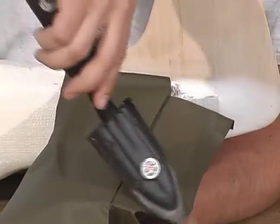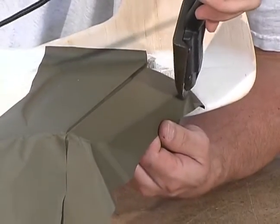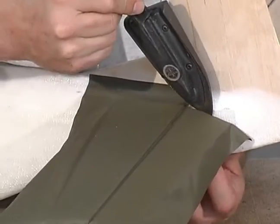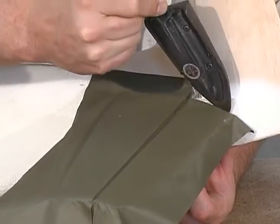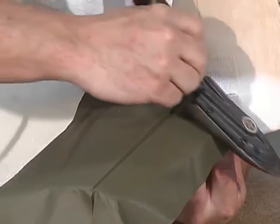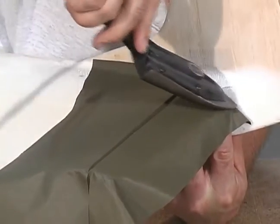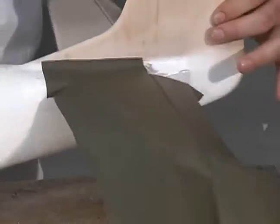This is using the same exact technique that I did when I did the aileron. So bringing it in tight, I'm going to use the back of the shoe to bring it in against that angled piece of the elevator. Now it's tight in between the body here, so you just have to work it. Use your tool. And with our heat gun, we're going to shrink the edges.